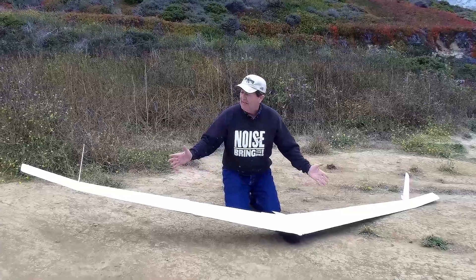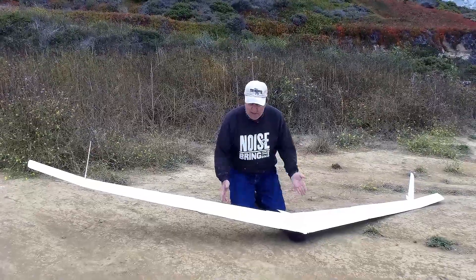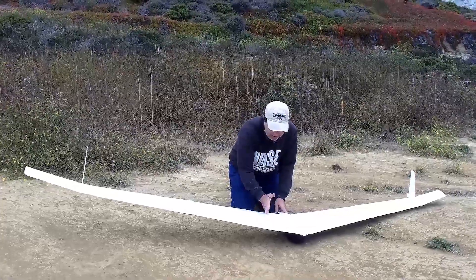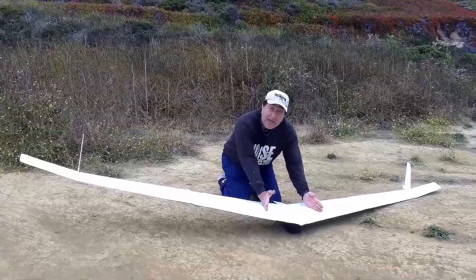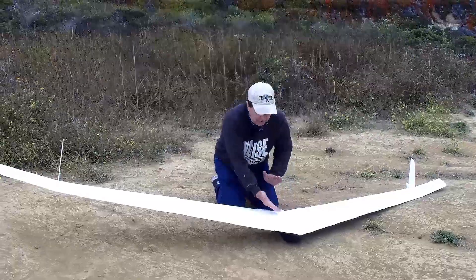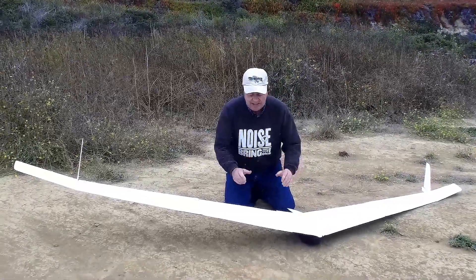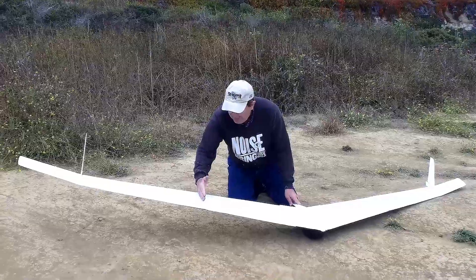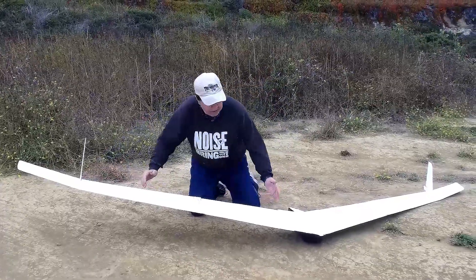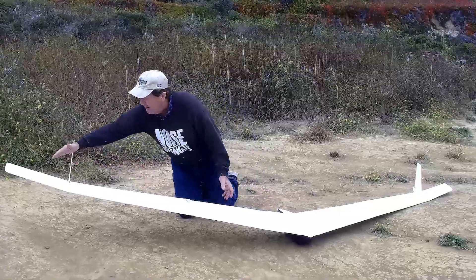What you're looking at today is the quarter-scale version of the wing in what I hope is the last configuration form. The model is a little bit different than full size. Full size will have a field joint here where this portion of the wing is a rigid center section. The cockpit components will fold up flat. There won't be a field joint here in the full-size glider, but there will be one out here at the winglet. So we're going to have an 18-foot section of the wing here, a short center section, and then tip panels.